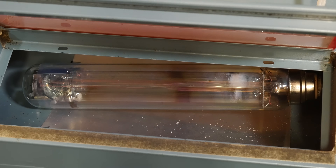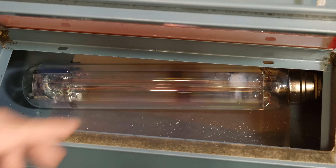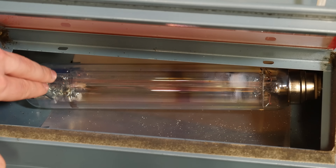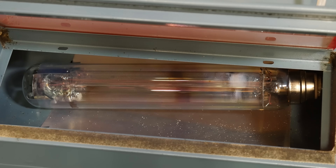I believe I have the camera in an auto-exposure mode, which is what I want. But before I actually start the lamp, I just wanted to explain that this is a very old lamp. I have no idea how many hours are on it, but I suspect a lot given the discoloration in that spot. The other thing that is interesting is the fact that the sodium seems to always hang out in this part of the U. There are a couple of kinks in the tube inside there, and I'm guessing that it's meant to restrict the sodium from moving around too much.